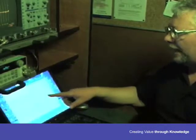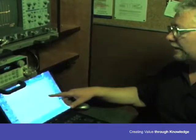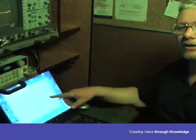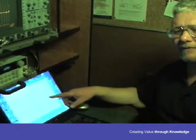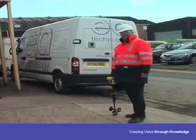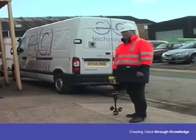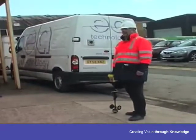Now that we've finished the high voltage testing, we've identified that our customer has a partial discharge activity site at 87% of his cable route length. Unfortunately, the customer has no idea of the route the cable takes from substation A to substation B. Introducing our new service, the cable locator: using the cable seeker, we can accurately plot the cable route length.